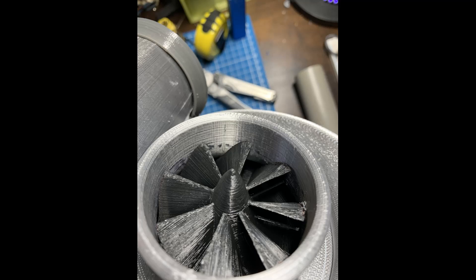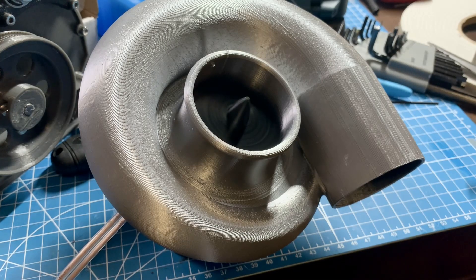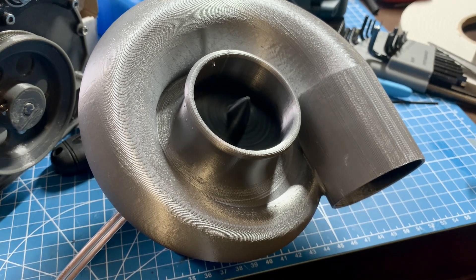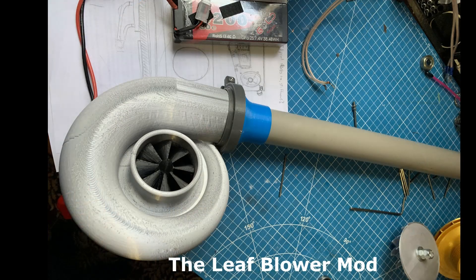The wheel needs to be printed out of something stronger or stiffer, such as polycarbonate or straight PLA. The wheel probably also needs to be balanced to go to higher RPM — I've been lucky so far it's relatively light and close enough to balanced, but at double the speed I'm worried it might shake and shatter. Overall this was a really fun little project. I may revisit it someday and try building it out as a multi-stage compressor to see what it can do. Thanks for watching and stay safe out there.